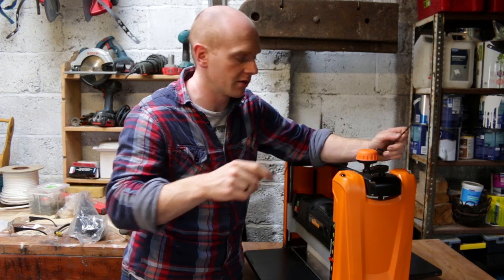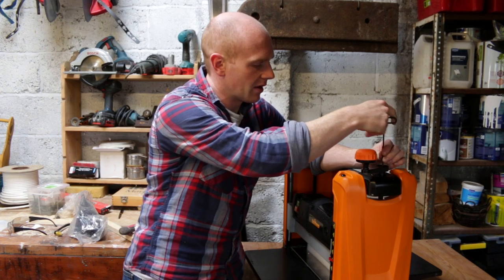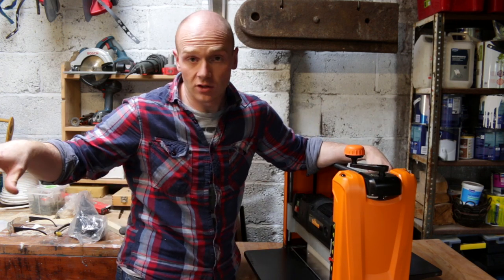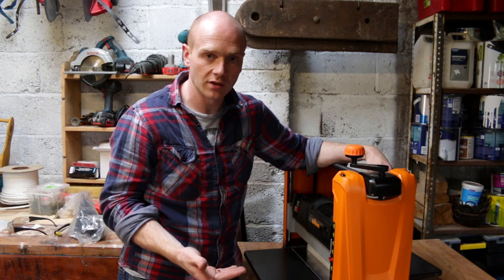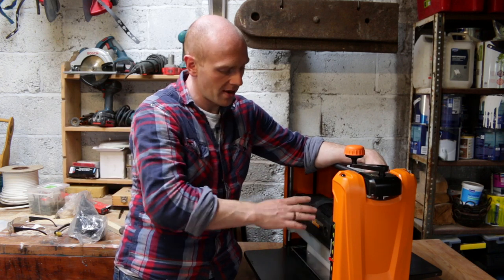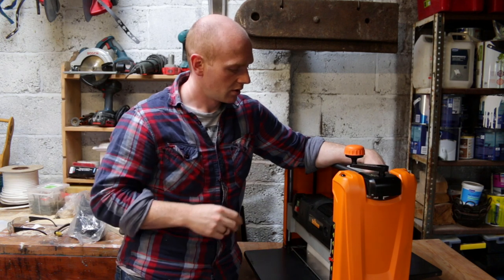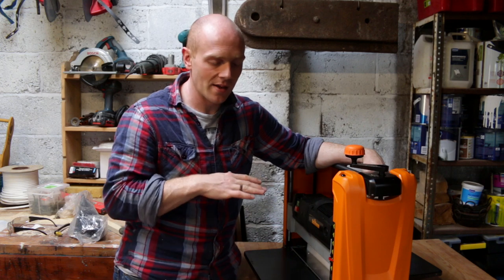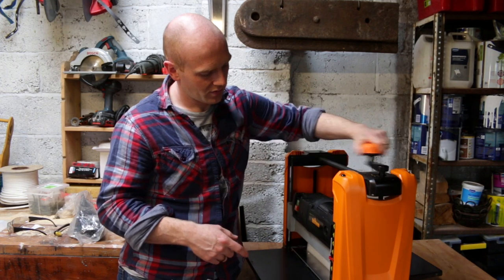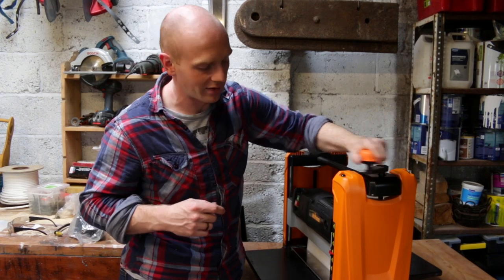With the help of this I'm hoping we can build all of our own cabinetry — the framing, the carcassing. The original plan was to buy a planer thicknesser, which is quite common here in the UK and Europe, whereas in the States you keep them as separate machines. Here you can get a planer thicknesser and use the top as your planer or jointer and underneath is your thicknesser. The only problem is they're much more expensive. Most of my timber is already dimensionally close so I think I can probably get by without the planer bed. Also this will get to six inches, which means we might be able to plane some of our oak before we do the construction work next year.